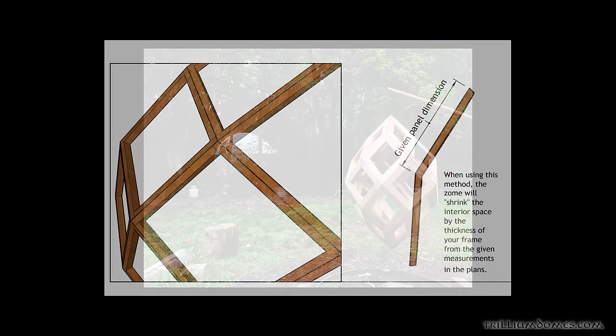The workflow is simple: each of the four struts that make up an individual panel can be cut long to short, each side is the same exact angle, and they're all the same exact length. When you get the plans you'll get an overall side length for each panel, and in zones those are all the same. The only thing that differs panel to panel is the miter angle. Cut one strut at that angle, measure the cut length, subtract from overall length, and that's your strut length. Once you're confident, cut four using the stop block method, assemble them, double-check your measurements, and keep cutting.